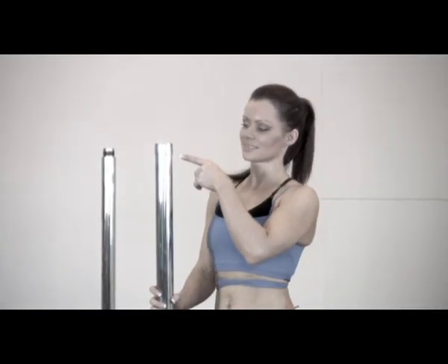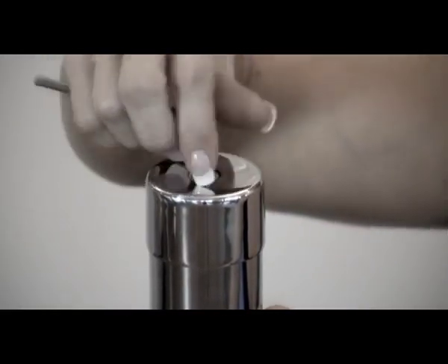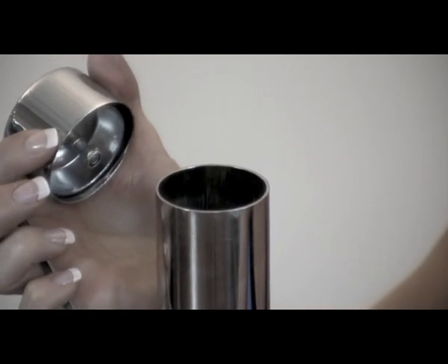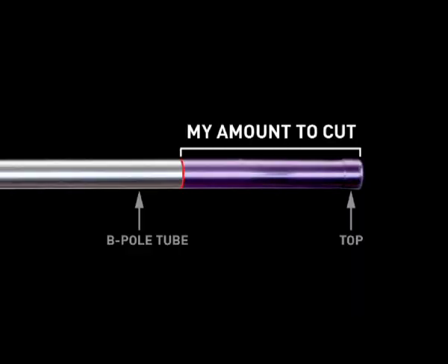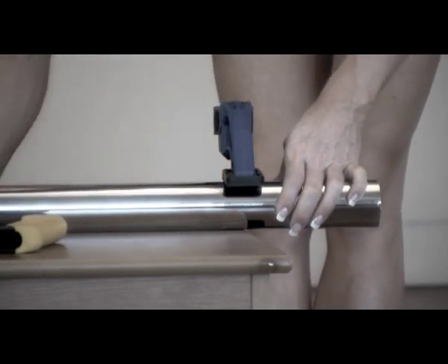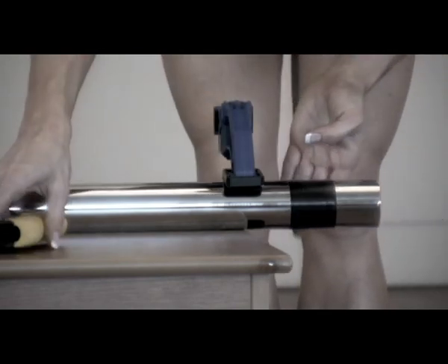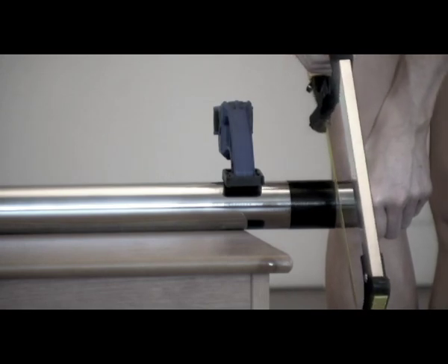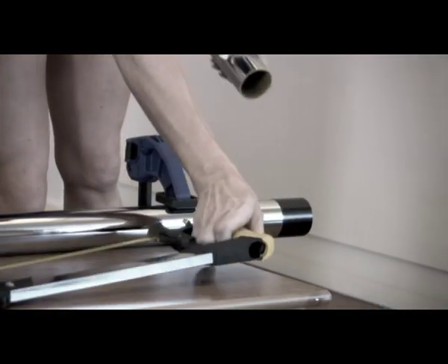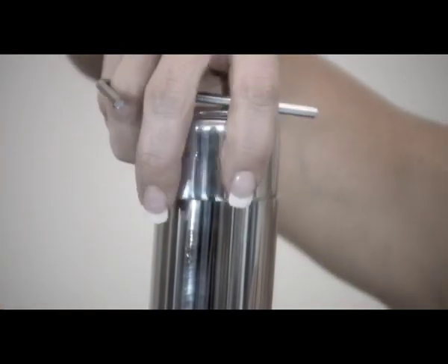To cut the tube, you will need to remove the top cap which covers the end of the B-pole tube. Undo the screw in the centre of the top cap and pull it off. Now from the top end of the B-pole, measure the length to be cut and mark it on the pole with a wax crayon or tape. Cutting the tube should be done by someone experienced, so we strongly suggest you take it to your local engineering or do-it-yourself firm. If you are experienced and confident, this can be done with a good high quality hacksaw. Make sure the tube is secure before cutting and ensure it is not damaged by how you secure it. No responsibility can be accepted for damage done during the process. Once the tube is cut to the required length, refit the top cap and firmly tighten the screw.